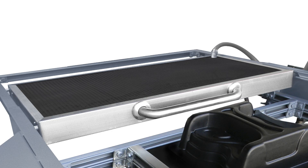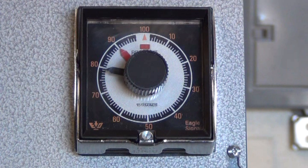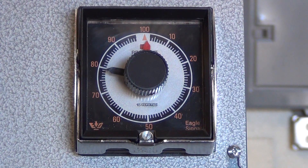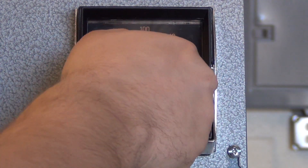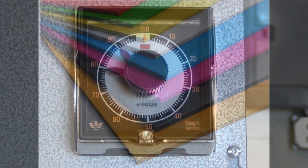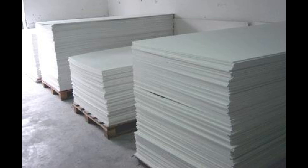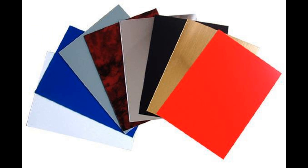The percentage controlled oven is specially calibrated to evenly heat almost all thermoplastics. It is controlled and manipulated depending on plastic type and gauge with this module located on the main control face. The heat of the oven is determined by a percentage of maximum output. For example, if the dial is turned to 50, the oven is producing 50% of maximum output. Oven percentage required will vary depending on plastic gauge and type. Most plastics will need to be heated with anywhere from 50 to 80% heat output. Consult your manual for recommendations.